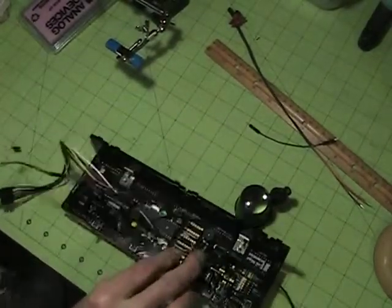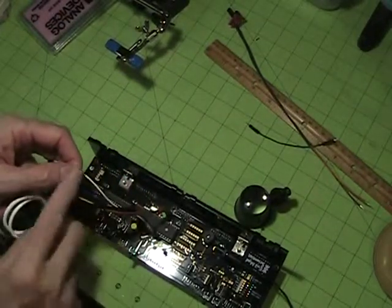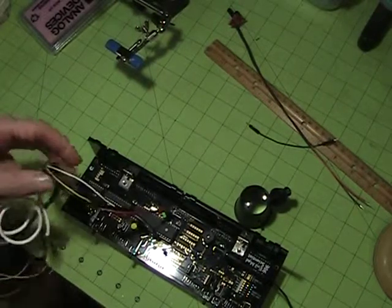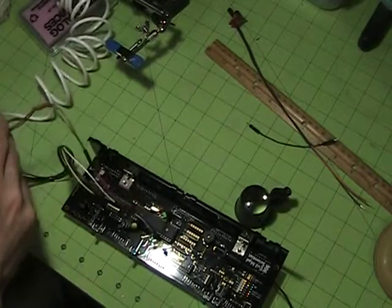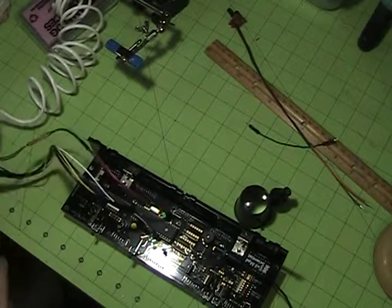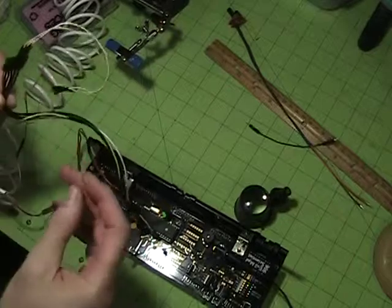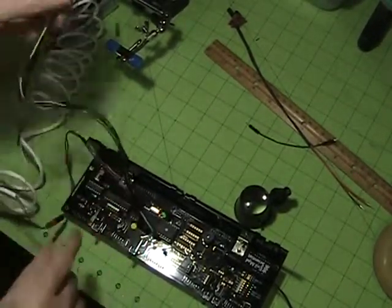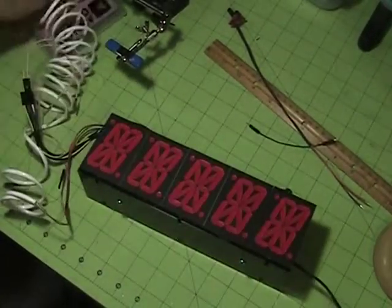We've got this white wire. I made the analog input. There's one analog available. Made that white to be easy to identify. We can measure things like temperature if we need to through there, or some other analog value like a position of a pot or a knob. That is the connector with the simplest demo code that reads a Hall effect sensor.